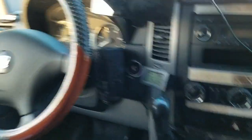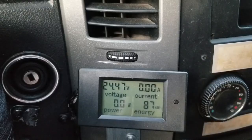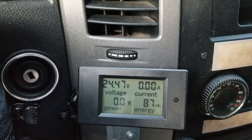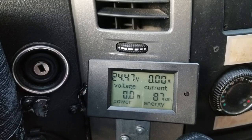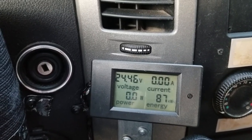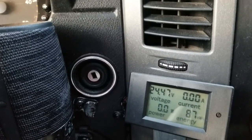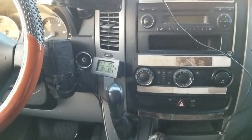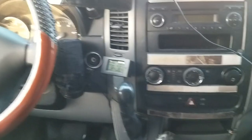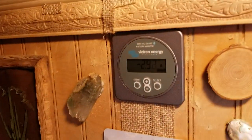The cabin also has a battery monitor, so when I'm driving and I want to charge the battery — let's say it's down to something like 21 or 20.5 volts — that's about the time I need to start charging. So I could be in the redwood forest or something with no solar, and I'll go drive around and joyride, all the while charging my battery. That's both eco-friendly and not eco-friendly. That monitor has its own individual shunt separate from the monitor here.